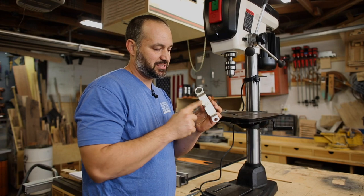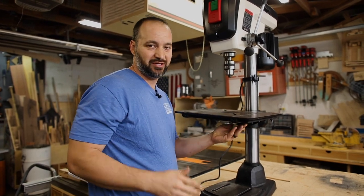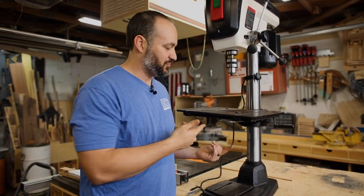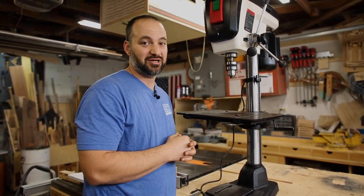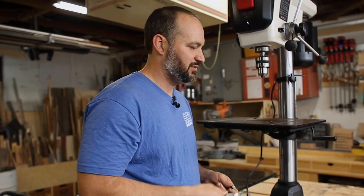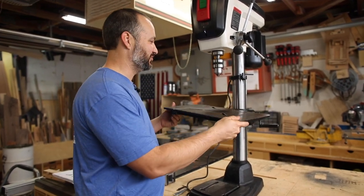It comes with this tool — it's got a nice magnet so you can just clip it underneath wherever and it's out of the way. But I would recommend just using a half-inch socket for the retaining pin and a 15/16 socket for the tilting adjustment bolt. This tool is a little uncomfortable in the hand and it's just easier that way. So let me grab a piece of wood and drill a test hole at an angle.